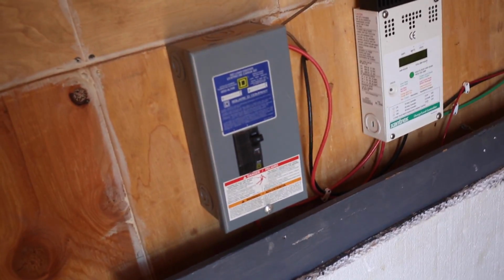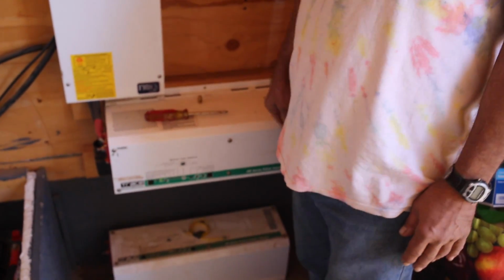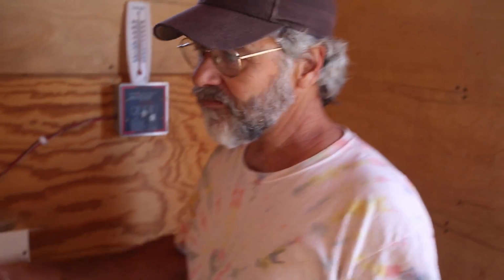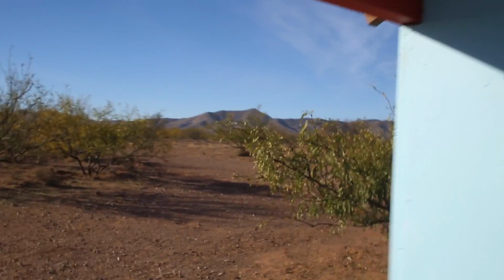We got a lot of this equipment, these two inverters, charge controller, and some other stuff off the straw bale network for really cheap. So that cut a lot of our expenses. This isn't the most modern equipment. They were used. Someone upgraded. This is like their modified square wave type of inverter. Now they have the sine wave. But it all works, and we've never had to use the generator. It's always charged, even if we have a few days of cloudy.